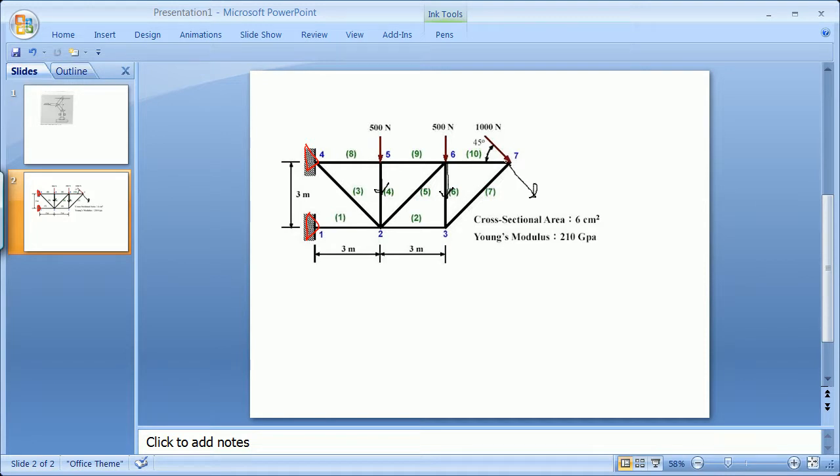And you pull this one down with your eye because you want to break it up into a component that way and a component this way. This one having no moment about point 4, and this one having, yes, in fact, a moment about point 4. And realizing, once again, you see this kind of problem thrown at you with a 45 degree, so you can realize that in effect this is a 1, 1, square root of 2 triangle.